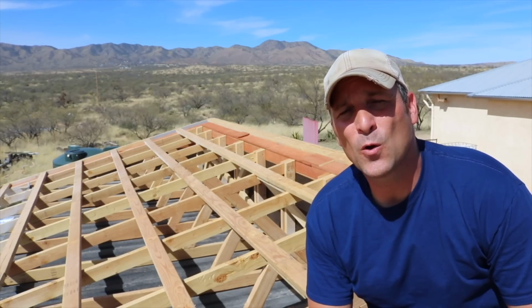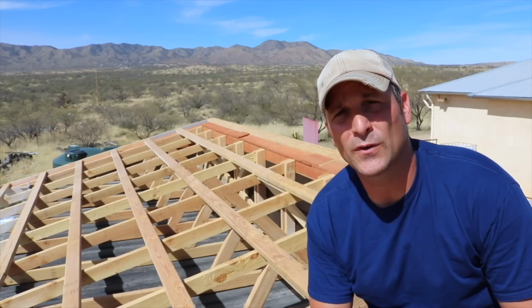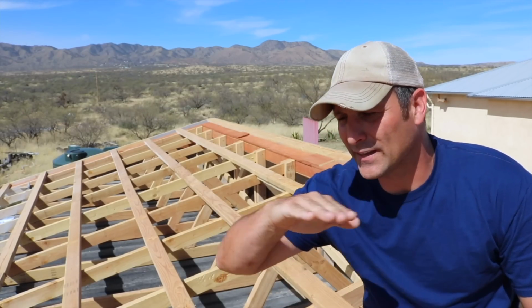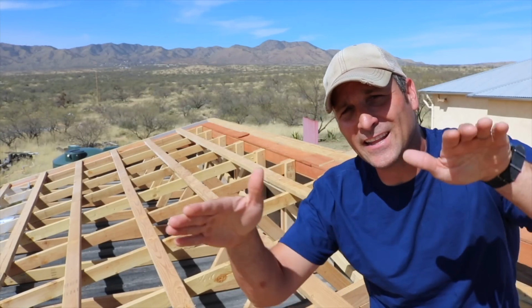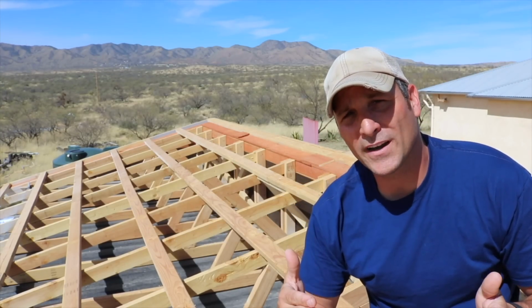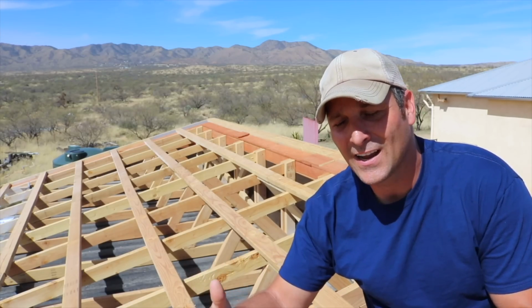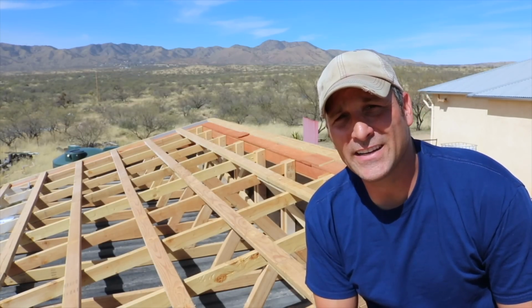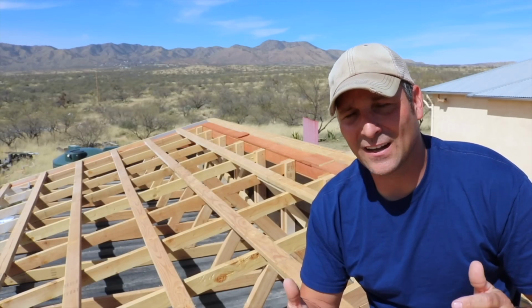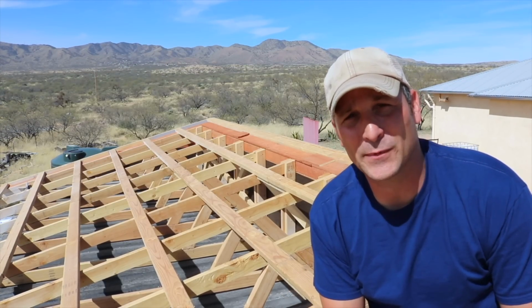In the instance of purlins, you're going to want to make sure to use at least 1 inch thick boards and space them according to the pitch or slope of your roof. Anything above a 3-inch rise within a 12-inch run is going to have 24-inch on center purlins, and anything flatter than that, you're going to want to consider spacing your purlins at 18-inch on center or 12-inch on center. Anything even flatter than that, or a structure that is going to have an interior ceiling, you should use a solid decking surface of at least 1/2 inch plywood with an appropriate weather underlayment.